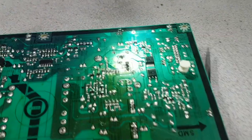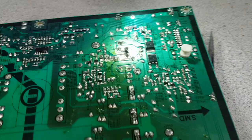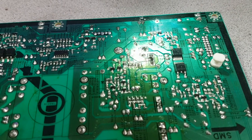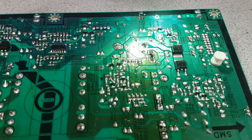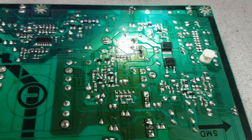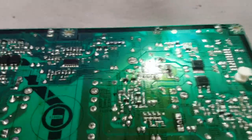In the TV repair world it's not called anything — you just have to deliver a working board. Over the years I spend time cleaning around the front and back, tilting and soldering the whole row, because you can see the signs on all of them. I also replace transistors that tend to fail. For Samsung BN44 boards — later generation plasma TVs, BN44-00513, 514, 515, 516 — both the VA/VS driver transistors and the PFC transistors individually tend to fail. When a board is here, I always replace both, but that takes more time.